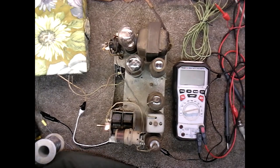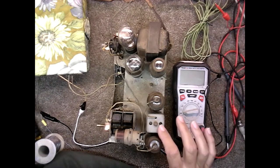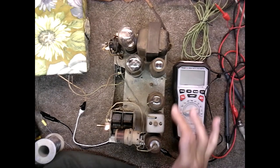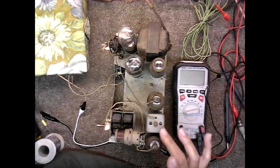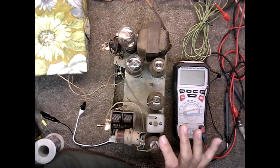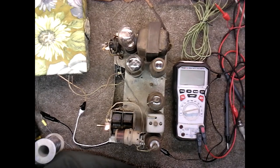So it's not really a tuned frequency radio, but it's on the border of switching from a full tuned frequency radio, which doesn't have an intermediate frequency like this one does, to an intermediate frequency radio, which would have two IF cans. This is an intermediate frequency radio. However, it has elements that are carried over from the tuned frequency radio, like this coil. This is a tuned coil.